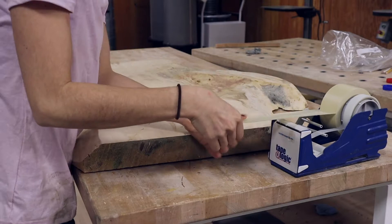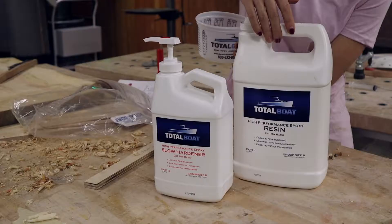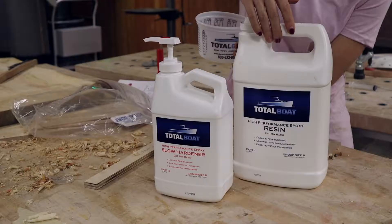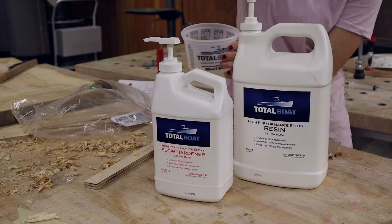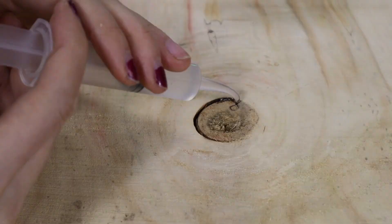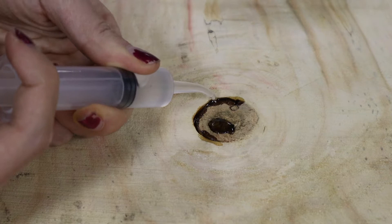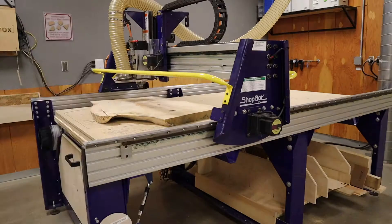One of the knots I need to fill actually goes all the way to the back, so I'm going to flip it over, put masking tape over the back so that it doesn't leak out and epoxy my slab to the table, and then fill it. Many thanks to Total Boat for not only being an awesome sponsor of today's video, but also being a great supporter of our non-profit arm and educational outreach. So I'm just going to take their two-part high-performance epoxy resin, mix it up, and then using a syringe, force it down into the knot. I've had issues in the past with epoxy not getting all the way down, and I did have that issue a little bit even with the syringe, but a couple passes of epoxy and everything gets filled.